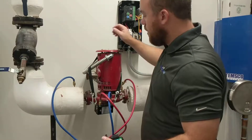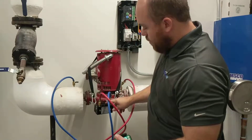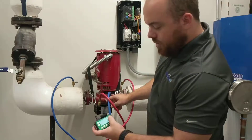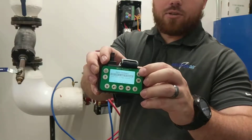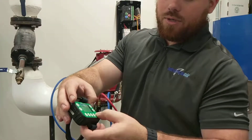We're going to close both of our hoses off 100% so that there's no new water entering our meter. We're going to purge both sides and go into our Evergreen. We'll go to options — you'll see there's a differential pressure to atmosphere option. We're going to pick that one and select it.